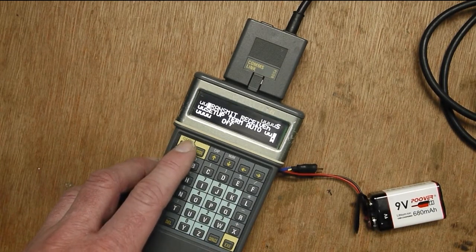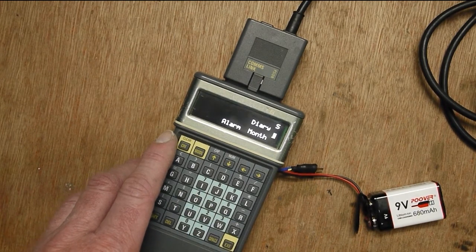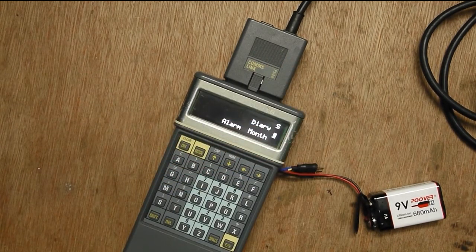There is one small problem in that it won't turn off properly now, because the comms link is holding it on, because I've got an inversion of the keyboard scanning levels. I've got levels that you pull up to actually detect a key, so you detect a key pressed with a 1, but the original organiser was a 0, and I've inverted everything in firmware, but obviously I can't invert it on the signal coming in from the comms link.